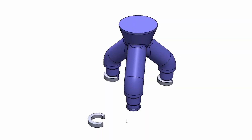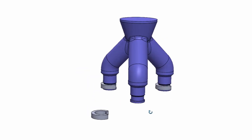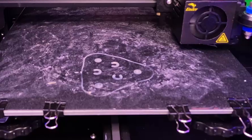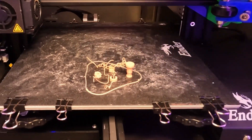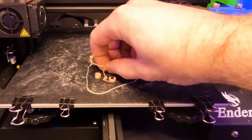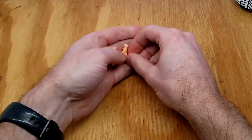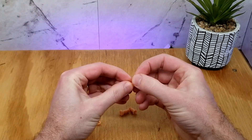So what did I come up with to make the spinning less awkward? I chose to make a little knob that sticks up from the top, using the three holes in the revolver plate. My idea was to push it through the holes and use little c-clips to hold it in place securely. The small dollar store plate has its own special one, but the other two use the same knob. I'm thinking this will make a nice carrying handle too. Not everything can go perfect all the time, but I'm not looking at this as a total loss either. From how far it printed, I'm able to get some valuable information — I've never printed c-clips like this before and just kind of guessed at the sizing, so this allows me to test that part out.